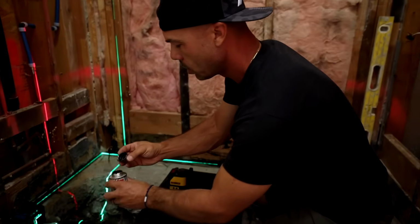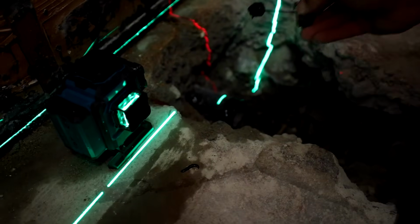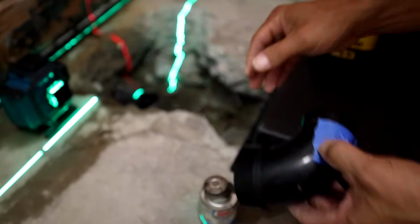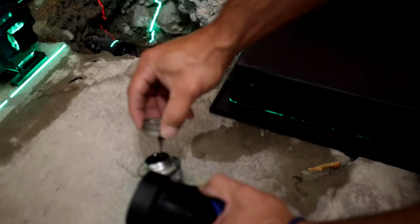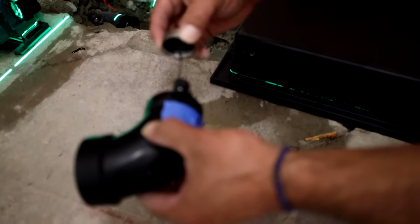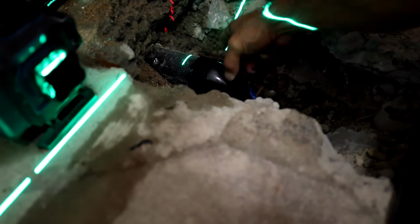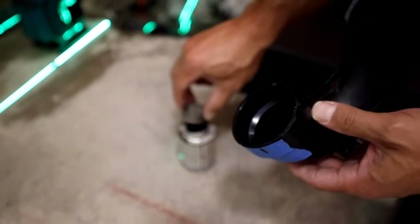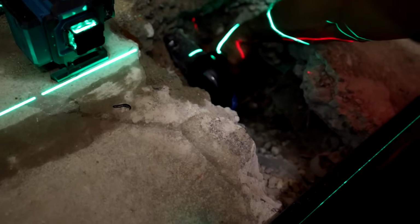So I'm going to start. I usually do cement on both sides of the pipe, inside and outside of the fitting. And since I have the fitting up here, a little low on ABS glue here, but I'm going to go ahead and get that. This one's just a 90 down. I'll get the inside. When you do both the in and the out, it does give you a little bit of working time to get your fitting in.